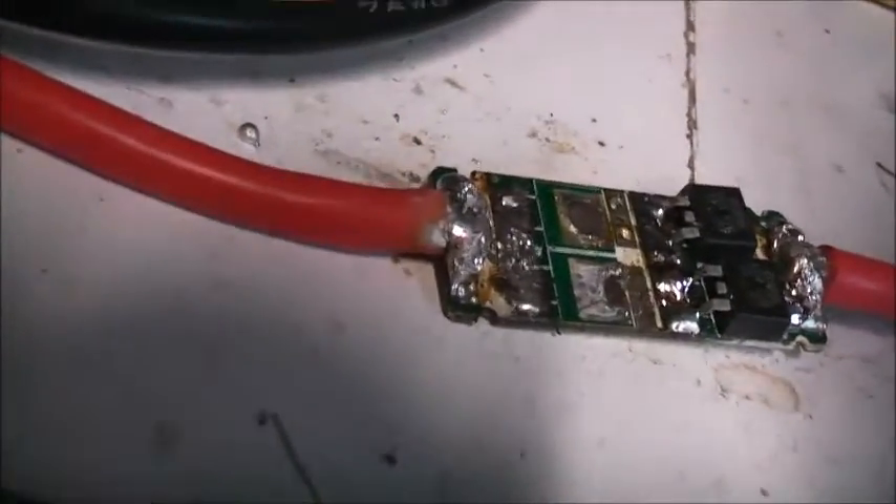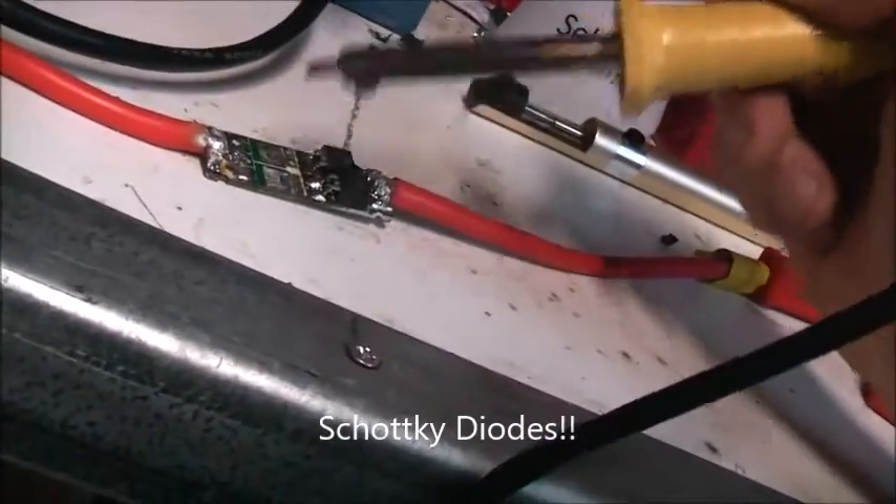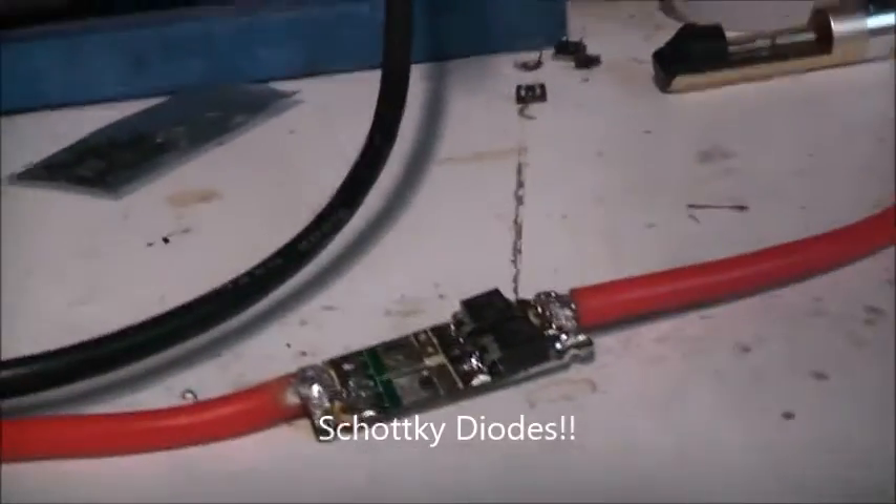What a mission - just getting it done. It's lead-free solder especially - that's what makes it even harder. I want to get this off before I solder those two FETs on. This has to come off so I can get my heat shrink on. The job looks the same as a factory job - dog shit quality, but that's how it was in the factory. It's a good solder. It's not very easy to do when you've got a small tipped iron. You really need a large tipped chisel point high wattage iron - it means everything.